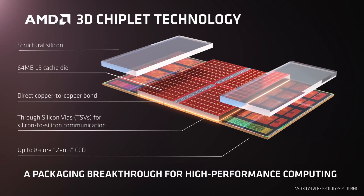Having the core chip at the top helps with cooling since it's nearer the heat spreader, but you still have to manage moving power up from the substrate. AMD is keeping the core complex on the bottom chip, which might have an effect on cooling. AMD has said that even though the top chip is smaller than the bottom chip, they've used additional silicon stiffeners to keep the chip the same length. That probably also helps with transferring thermals through the silicon, though it's still a bonded situation which may have lower thermal efficiency than a single unified piece of silicon. It's going to be interesting to see how this plays out in terms of cooling.